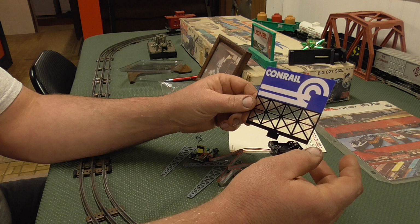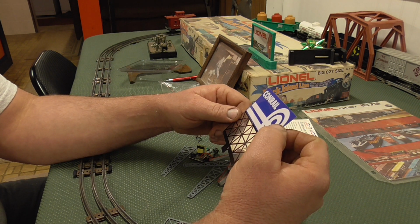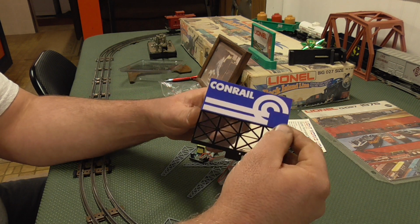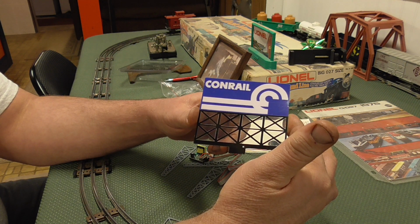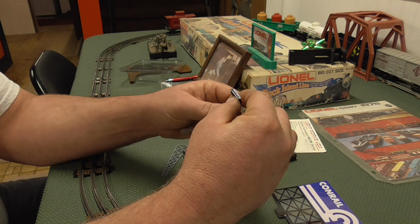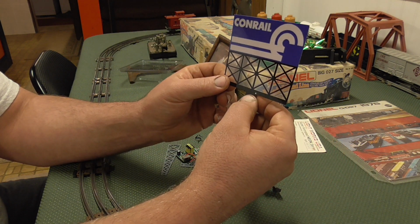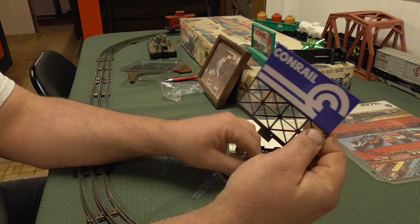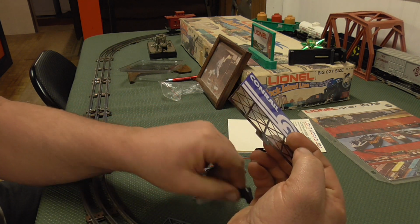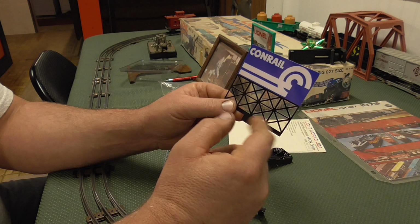So we already talked about a couple do's and don'ts with this. Like I said, these are very delicate. I'm going to share my experiences with these as I found a couple things out the hard way. My first 2 signs burned up, and it's not Miller Engineering's fault, it's my own. The first building I went to put it on, it wouldn't quite fit in there because, as you see, you have this long lead. So I was trying to put it in a building that was a tight spot. So what I did is I took this, and I'm not going to do it to this one, and I bent this tab back so it would plug in like that. I wanted to be able to plug it in like that, so I bent this tab back. Well, that was a bad idea, because what happened is that just broke all the wires inside. It took a while for it to show up, but within a month it failed and it burned up.